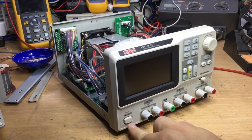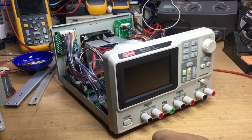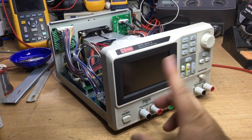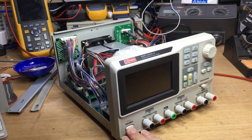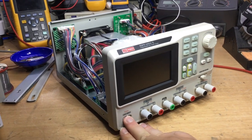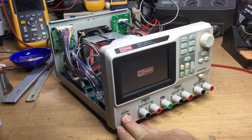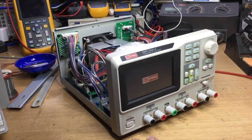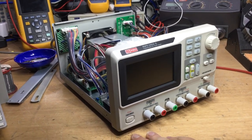You can just see the fan trying to turn, but it ain't doing it. Just leave it off for a few moments. So what I might do is spray that bridge rectifier with, there you are, look, it's come on. Although I pressed it to go off already, I've latched it. Let's see whether that, so it's back again. There, it's gone.